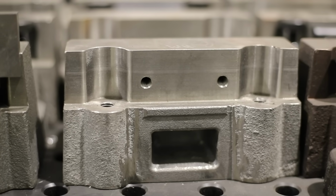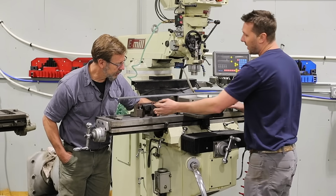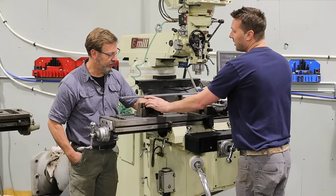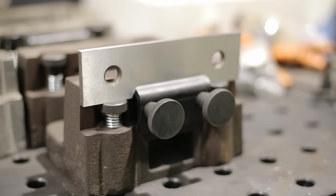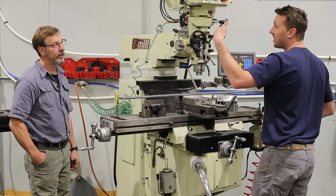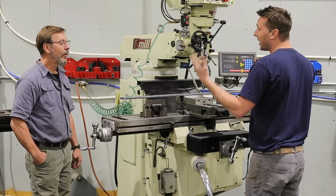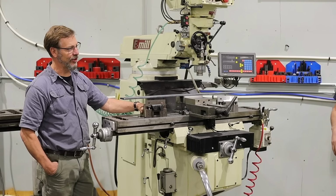Yep, so they're toolless, and then you could take them out and put a set screw in there. Then they have spherical washers. And then they'll take an 1/8 inch or a 1/4 inch parallel. Or you could set this down an 1/8 of an inch lower and run the next size up parallel. So you can utilize that, because that's the other thing: some people don't have enough parallels. And you could do it that way.